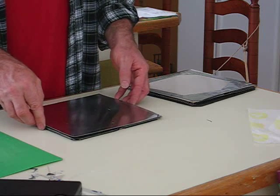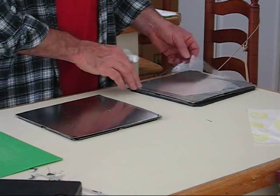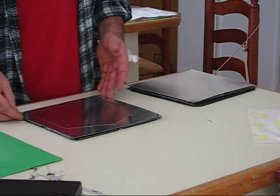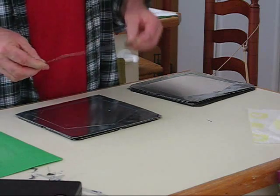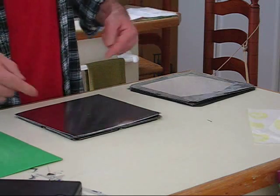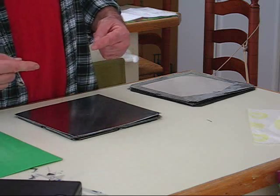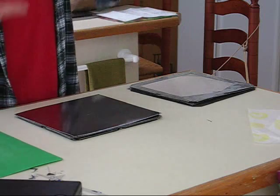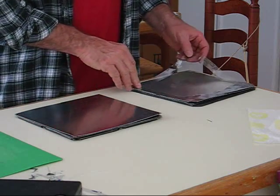Here's another difference coming up. Every time you have a hole — top or bottom — you have a chance of voltage leakage. I'm using five neutral plates; that's a nice odd number. So the middle plate, I just left the holes out — there's no holes at all in the middle plate. The water will flow in from both sides to the middle and just work its way up through the plates. There is no hole in the middle on the top either, so any gas will flow up and out through the top two holes. We're going to have two feed lines in the bottom and two exit lines on the top. With no holes, that's at least one less chance for voltage leakage.